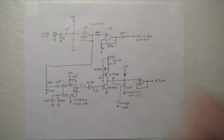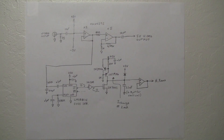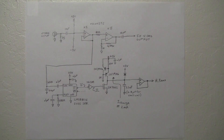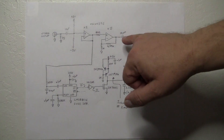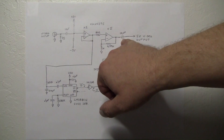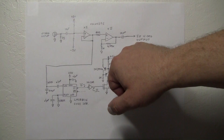Coming out of the first amplifier, the video is exactly the same level as it went in. It goes next to an amplifier which has a gain of five times and basically takes one-volt peak-to-peak video and boosts it to five volts peak-to-peak, which is a requirement of Eric's CRT controller board. I again AC couple this video signal and send it over to Eric's board.